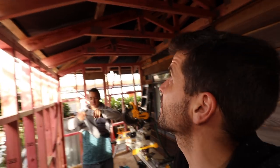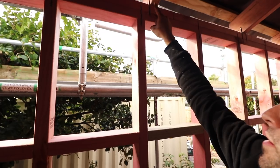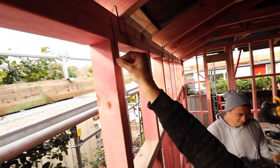Let's start from the top. Basically, your roof is screwed to your purlins, which is screwed to your trusses. Then your trusses are connected to your top plates, and your top plates are connected to your studs with these z-nails.